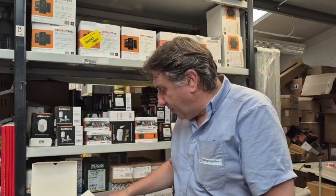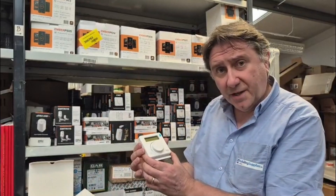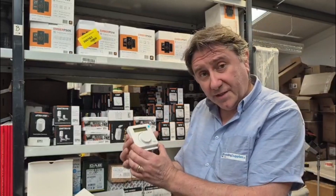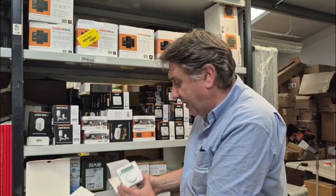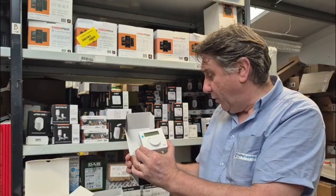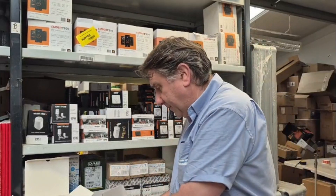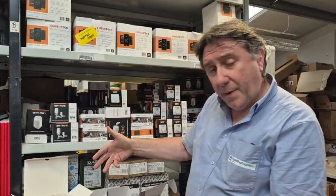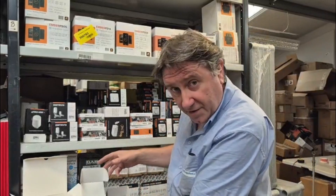So this is the controller. Each zone is basically monitored by the thermostat here. This is a wireless thermostat — it's based on RF, so it communicates back with the controller wirelessly. That's an RFR for each zone within your house. This is a thermostat for your hot water — it's an RFC, again wireless, and it communicates back with the main controller. No need for any wires between it and your controller. Each ember pack comes with different numbers of RFR room stats, with or without a cylinder stat, depending on what you want.